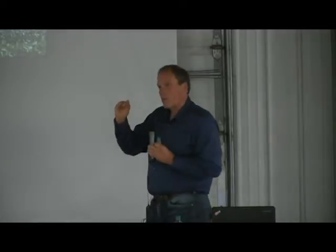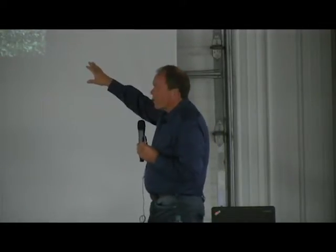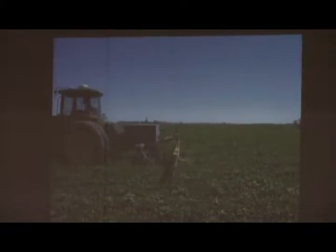Works well when you have scattered weeds, not heavy population of weeds, and the weeds have to be taller than the crop. It's got a 60 kW generator that's PTO driven. It energizes that bar that you hold right above the growing crop. And then when it contacts the weed, it grounds out, electrocutes the weed. The weed's dead immediately. It also works well on certain species, but it doesn't work great on all species. So it depends what you're dealing with. But I wouldn't race right out there and think that this is the silver bullet, because it's not. I find that one year I'll use it a lot, and then it'll sit in the shed for 5 years.